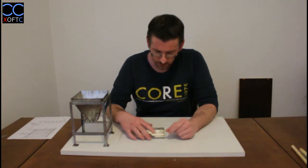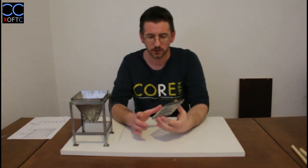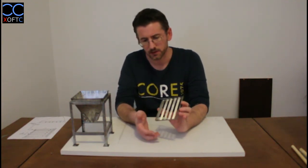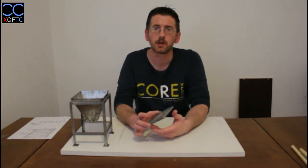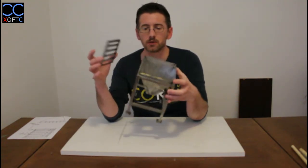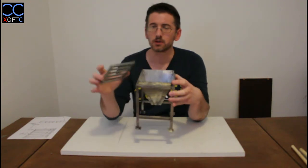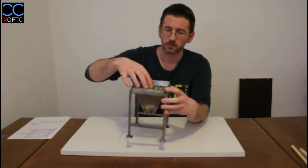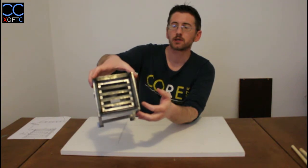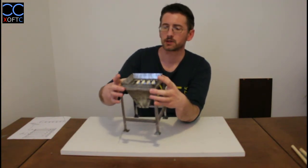Okay, so we've finished our element. It's now clean and it's all soldered up. You saw how I made the frame and how I added these in the middle. Not really difficult things to make, and you can see how this will come into place. So there is a hopper here, and you can see material will fall through it, and we want to prevent clump material or hard material to fall through the hopper. So we have produced this bull guard, and we're going to place it inside, and you can see that it simply rests inside on the same level as the support braces. So this is basically what it does.